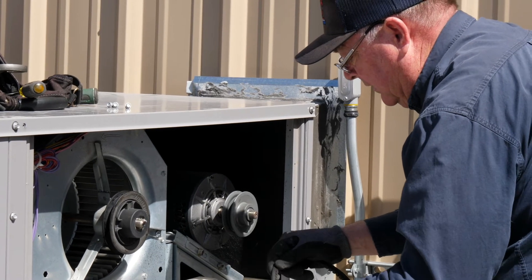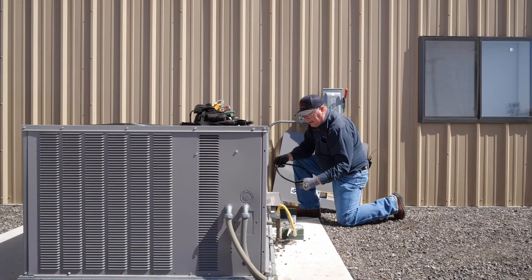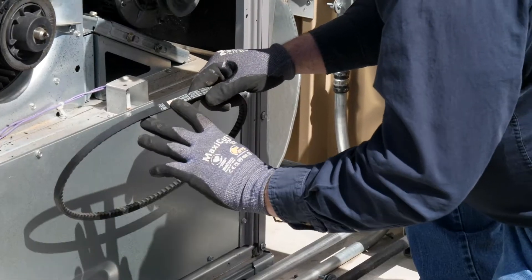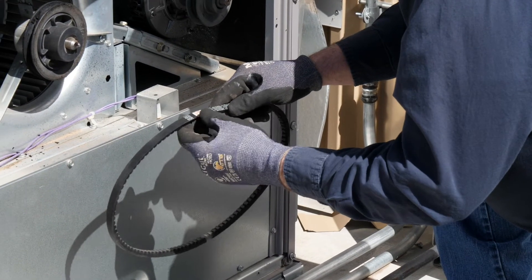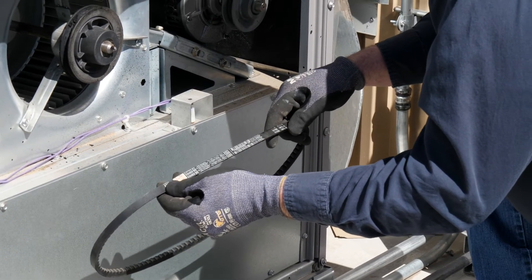You need to go through it and inspect it — check through it and see wear spots and see cracks. If the belt looks like it's good enough to keep on there, on the back side of the belt it tells you what the size is. This belt is an AX39; it's going to be a number like that.